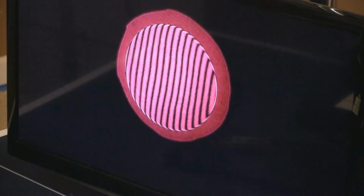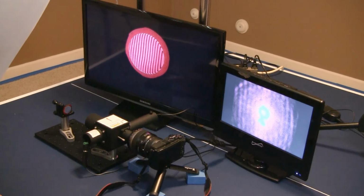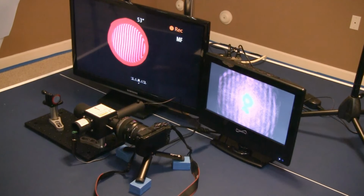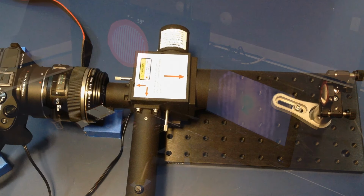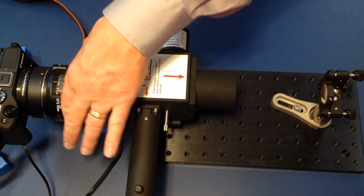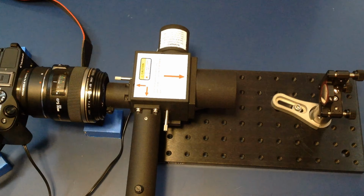When the intensity of the signal beam and reference beam are approximately equal across the aperture of the test mirror, high contrast interference fringes will be observed with a digital camera. It will be necessary to assure that the image of the test article produced by the digital camera lens is focused on the test article, and that the image of the test article is not vignetted by the aperture setting of the camera lens.